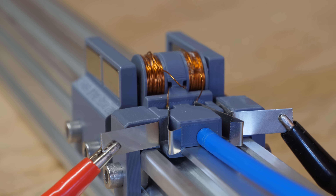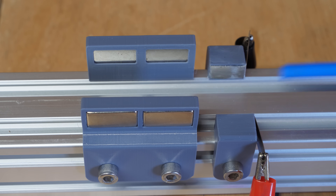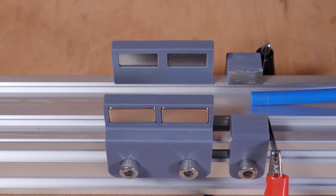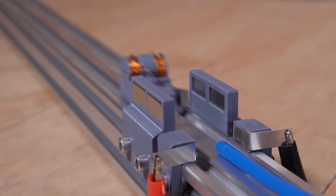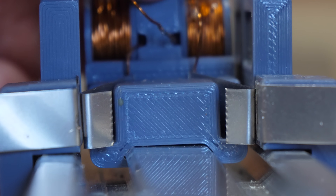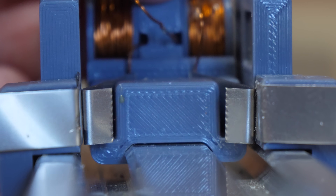What I love about this design is it's purely mechanically timed, as the position and length of the strip can be adjusted to power on and off the coils at just the right time to accelerate the sled. But these contact strips aren't ideal as they need to be perfectly aligned to make good electrical contact with the strips on the rail. But I think I know a solution.